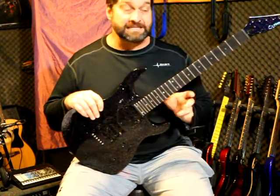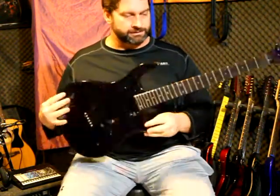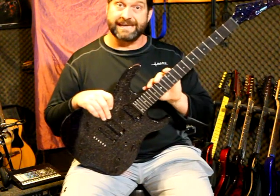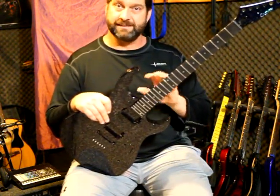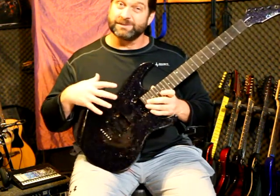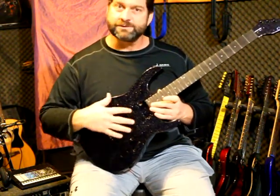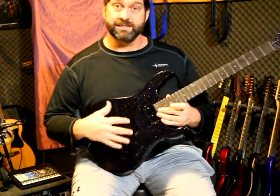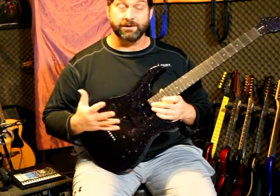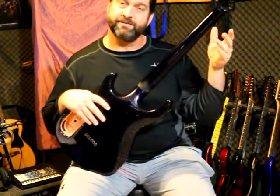If you want just a little less gloss but want to keep the looks of your guitar, be aware that as you sand it's going to become lighter. With a nice black guitar that looks like patent leather, sanding will lighten it a bit, and with more rough sandpaper some of the paint effect starts to disappear. If your guitar has a pearl or flake finish, sanding will lose a little of that. Same thing with matte clears — you lose some of the pearls or the beauty of different woods, quilts, or flame tops. I'm going to go sand this down and come back to talk about the different sandpaper grits.